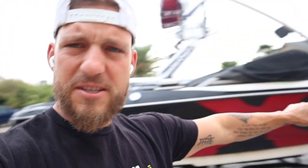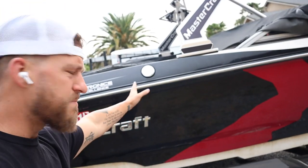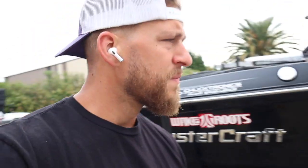I'm thinking half of this boat is actually pretty good. All the way until about this Mastercraft area right here we should be pretty good with just compounding and buffing it. Then on the back end - I'll show you right here - we're gonna have to do some sanding.